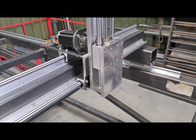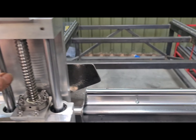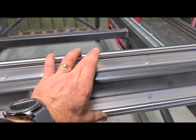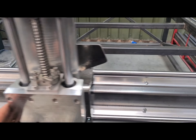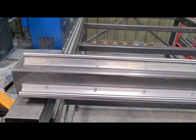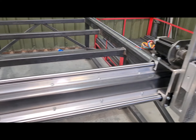There's just over a thou difference between this rail and that rail on that gap all the way along. From one end to the other we've got just about a thou, a little over a thou - and that's thousandths of an inch - so it's pretty accurate.